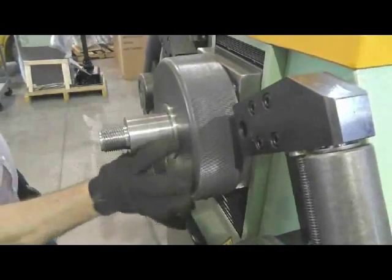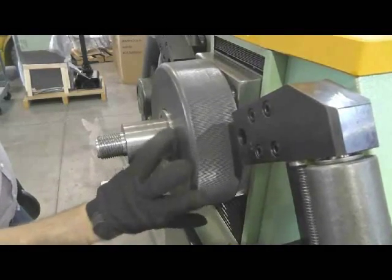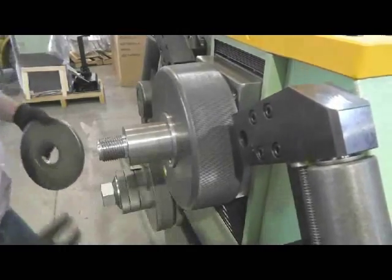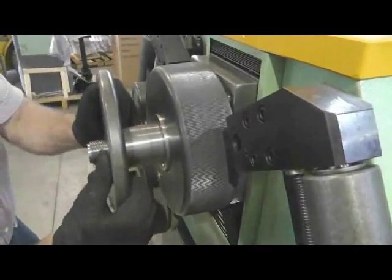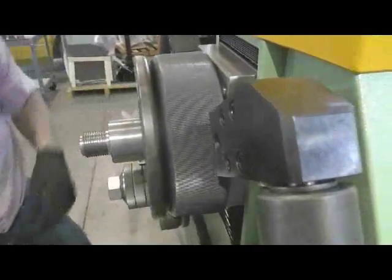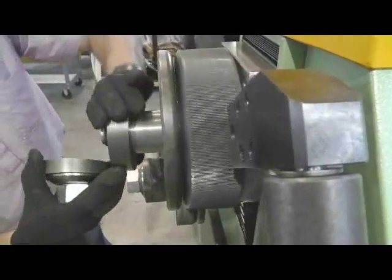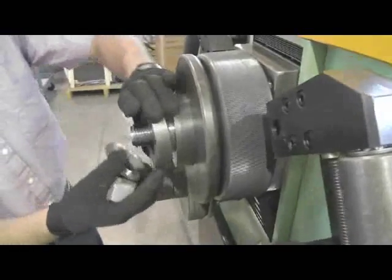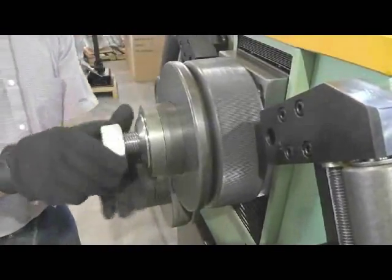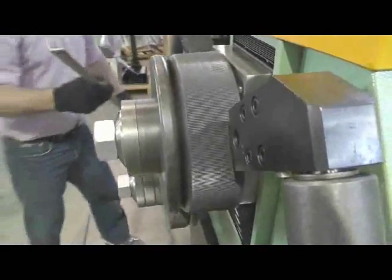This shaft is not keyed, so this rotates. For the lower shafts that are keyed, you'll have to adjust it and then slide it onto the shaft. I'm adjusting for the thickness, and I'll use the standard tooling thin shoulder flange to adjust the gap. Then you complete the rest of the remaining space in the shaft with the existing core spacers. What you want is a slip fit of the angle profile.